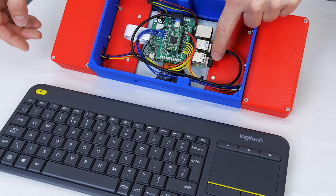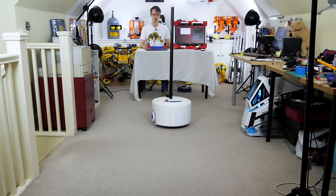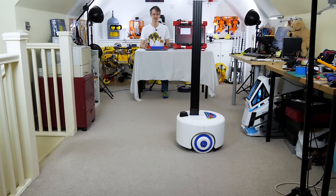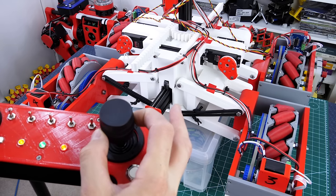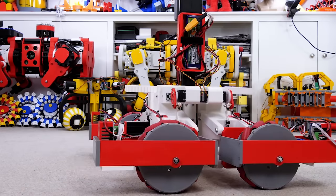I also built a Wi-Fi remote with a Raspberry Pi to control ROS-based robots. That involves either having a Wi-Fi base unit nearby for both the robot and remote to connect to, or making an ad hoc network between the two. Then we're at the mercy of a TCP or UDP connection. I can't find any other specific modules that would work reliably with an Arduino so I can build a custom remote or shove arbitrary data into it. Having a reliable low latency connection is really important.